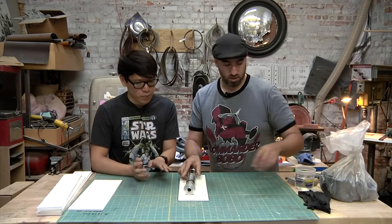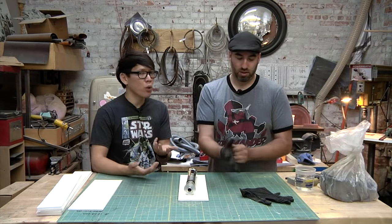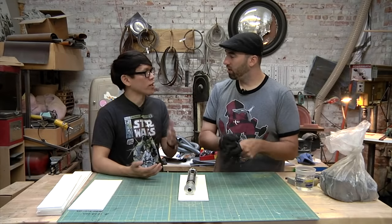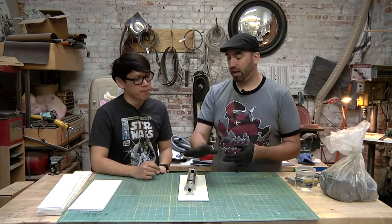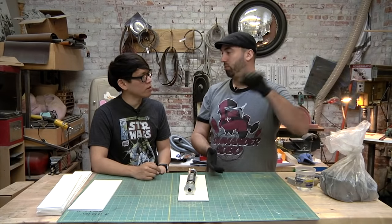Okay. So it's real easy to start off with silicone because it's forgiving. All right, so you have the space, and you talked about creating clay. So the two halves of the mold are created one at a time. Yeah, we have to put clay to separate the first side that we're going to pour. And we're going to flip it over, pull that clay off, and pour the second side.